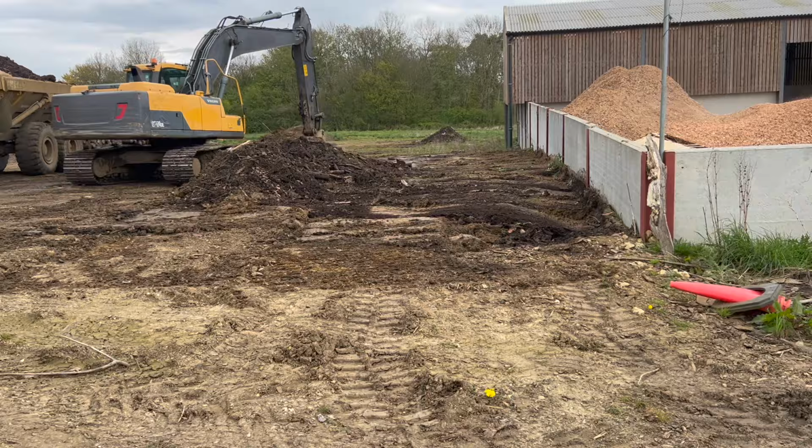Okay guys, I'm back up on top of one of the drying bins here, coming out of our kiln, which is just there. This has got the digestate in it, and just walking on top you can see a real clear line where it's dried and where it hasn't. So I don't know what it's like down beneath. This is super dry where I'm standing, where the air's just coming directly up, but it kind of cracks and then the air rushes through this middle dry bit, it doesn't do the sides. So I'm hoping that as we go further down into the bin, we'll find that there's been a more evenly drying process through this.